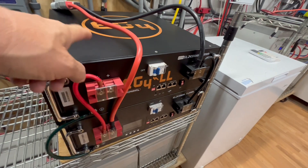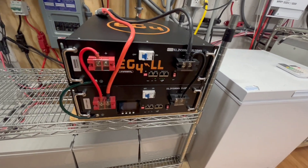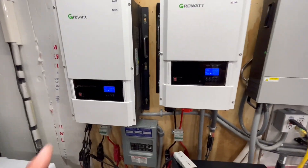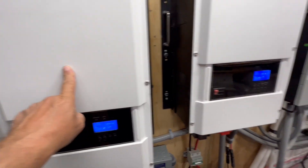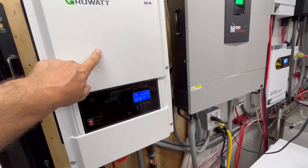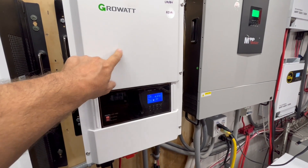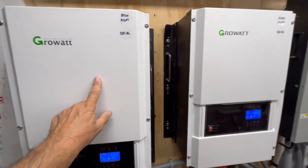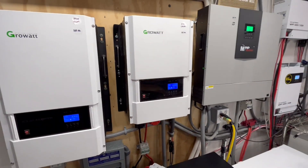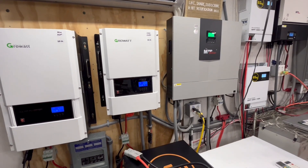So we know you need at least two batteries to start a three-and-a-half-ton heat pump. I've been able to start everything off of this. I was actually able to run my three-and-a-half ton on the six-kilowatt. This is a 12-kilowatt Growatt low-frequency, and a six-kilowatt Growatt low-frequency.